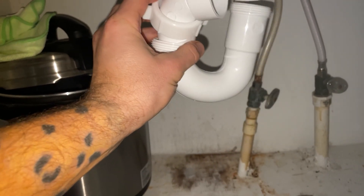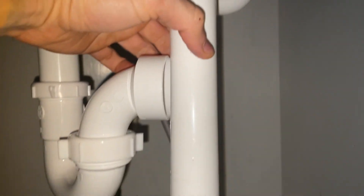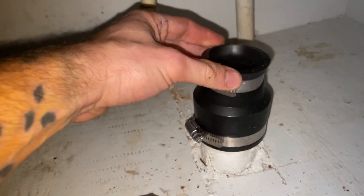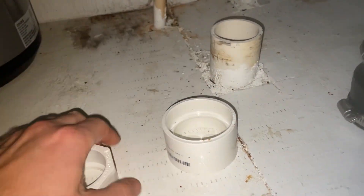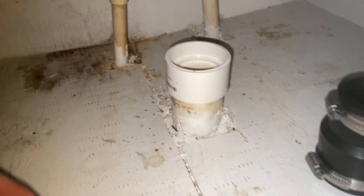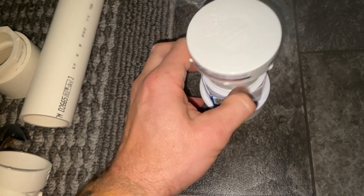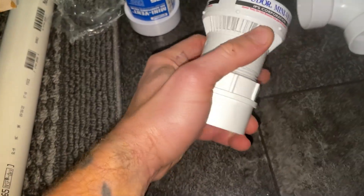The plan is to play with angles and turn the P-trap curved pipe the opposite way from the existing vertical drain line, and that will extend slightly to the side using a 45-degree coupling. For the existing pipe you can either use the same boot that goes on top, or a combination of a coupling with a bushing reducer from two-and-a-half inches to one-and-a-half inch. The air admittance valve came with a connector to a two-inch pipe, so you build depending on the size of your pipes — I had to get a connector reducer with threads to one-and-a-half inch.